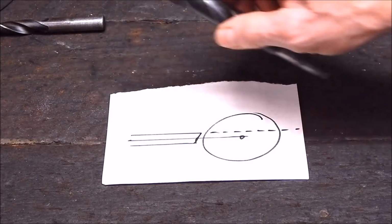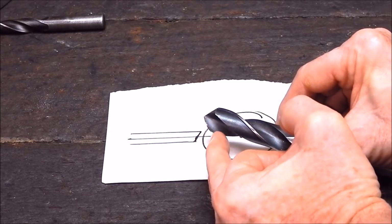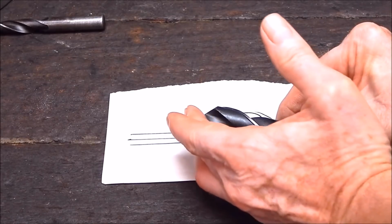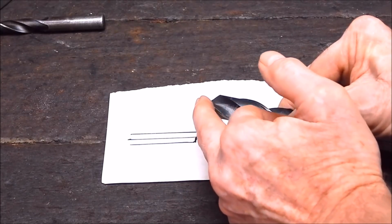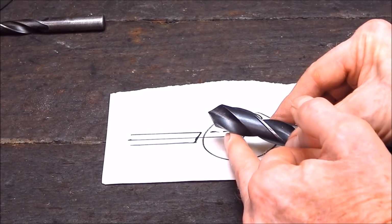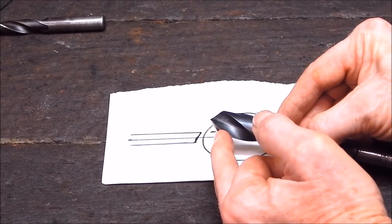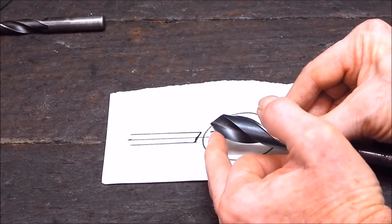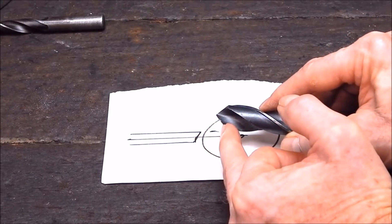And at the same time, as you run it across the cutting edge, you're going to even up, straighten up the cutting edge. You have your flute on the horizontal, you run your grinding disc across it, below center, you can see what's happening. This round stone's coming along underneath, and it's grinding a concave. Once you've done one side, you keep everything in the same position. You've got your carriage locked down, you rotate around the chuck to get the next flute on the horizontal. You repeat the process using the top slide just to move the grinder across. And not only will you have two concave sharp cutting edges, the angles of both cutting edges will be exactly the same.